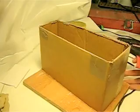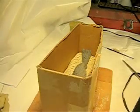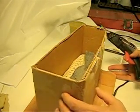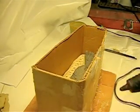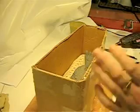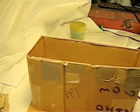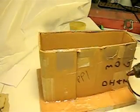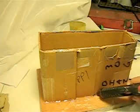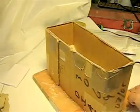This process is going to be repeated for all the other parts. I'm also going to show you after this how to do a one-part mold. Two-part block molds and one-part molds are the predominant ways to do molds for rapid prototyping for kit production. So I'm not going to go through every single part for this video. I'm just going to show you this one basically, which is a two-part, and then I'm going to show you a one-part after this, and then the next time we'll come back, I'll have all the parts rolled up and ready to pour, and we'll work on pressurizing the silicone and pouring the molds for the next video. I mean, this is stuff I've covered in my earlier videos, but a refresher.